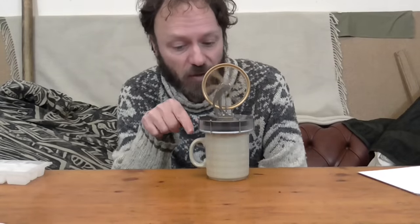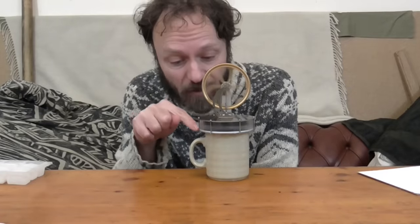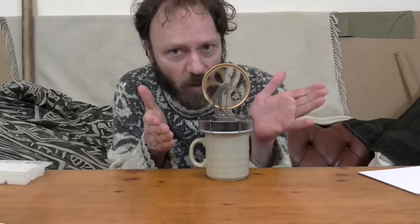And you can see that it's going a fair bit faster than it did with just the ice. So the temperature gradient between this very hot water and the steel plate now at the top. So now the top is the cold plate and the bottom is the hot plate. The temperature gradient is clearly quite a bit more because it's going around quite a bit faster. So the bigger the temperature gradient, the more efficiently this thing works,